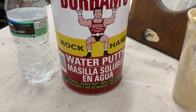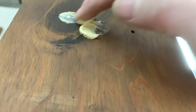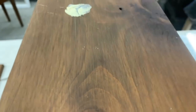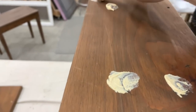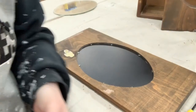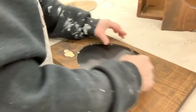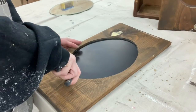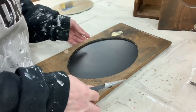For this piece, I just mixed up some Durham water putty to use as a wood filler. This had some knobbies where you could see crevices and all the nail holes that you don't really notice when it's brown wood tone, but once I was going to paint it white they would stick out. So I'm filling those in using this water putty - you just take a little bit of the dry powder and a little bit of water and mix up what you need. I decided the mirrors were just stuck in by these little metal pieces that you hammer in. I was able to get one removed, but the other I could not get lifted, so I ended up removing them all together.